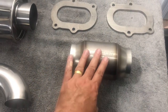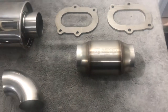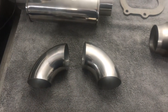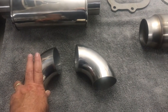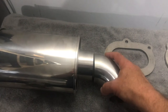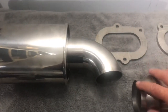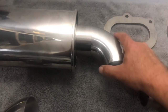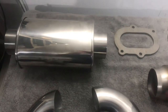These are the catalytic converters made by a company called GESI - these are 400 cell catalytic converters, as good as OEM catalytic converters. They're very expensive; they recently almost doubled in price. I was waiting for a sale, ordered them when they went on sale but they were out of stock, and when the new ones came in they were double the price. These are 304 stainless steel tubes from Amazon. One thing to note - the cat and the resonator pipes are just a little bit oversized so they slide in, giving you a little bit of adjustability before you tack and weld it up.